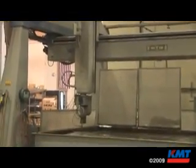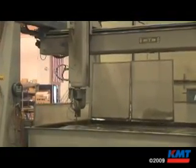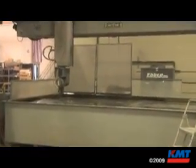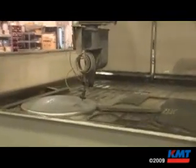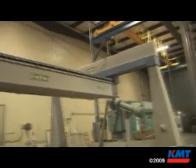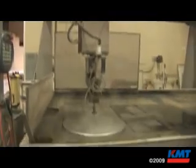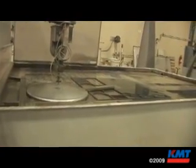This is our PAR integrated five-axis vector — an eight by twelve gantry-style five-axis integrated cutting system. It's utilized for doing contouring in full 3D, full five-axis cutting. There are a lot of two-axis machines out there, but our customers are looking for that competitive advantage. With our five-axis system, we can cut just about any contour with a three-foot Z, full eight by twelve rack and pinion drive, open on all four sides for access to bring product in and take finished product out.